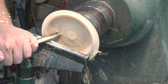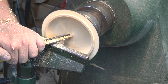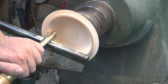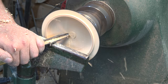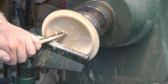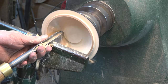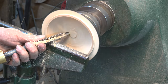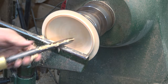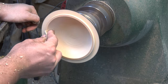I'm just establishing the bottom a bit more, being quite cautious because I don't want to go into that mortise in the bottom. Get a nice flat bottom, then curve it in all the way from the rim down into the bottom. One more cut to finish. I'm going to be using some sandpaper now, just to sand back a tiny bit.